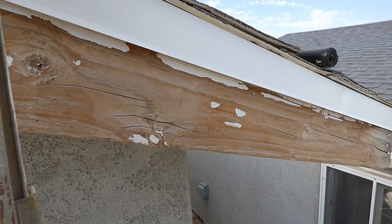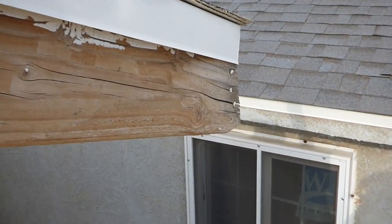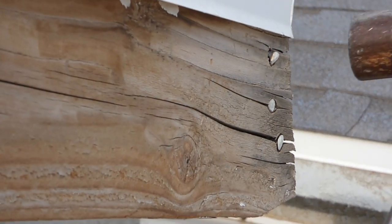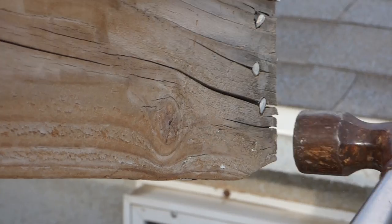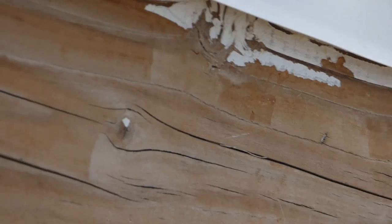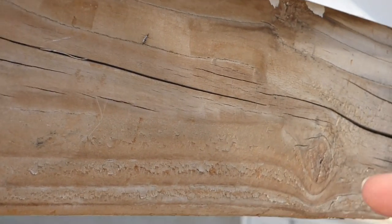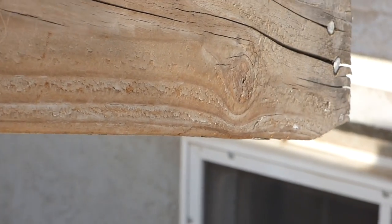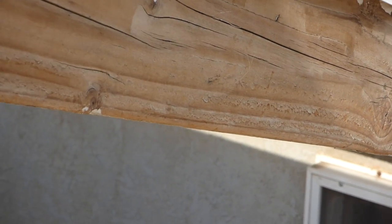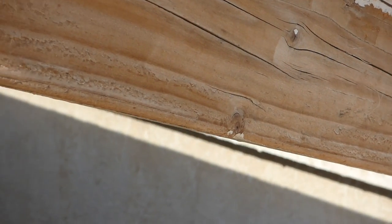Next, if you have nails like down here that look like they're pretty good, I might just try to tap them in a little bit. If there's a nail that's actually protruding too much or it's just not going to make it, I like to take it out and drive in a construction screw — a nice one that's a little bit thicker than the nail that came out. That should fill the hole up just good and keep stuff from having bad issues.